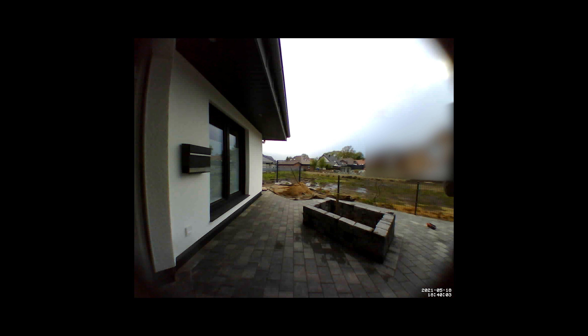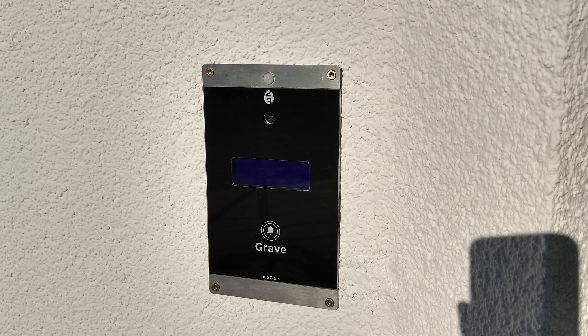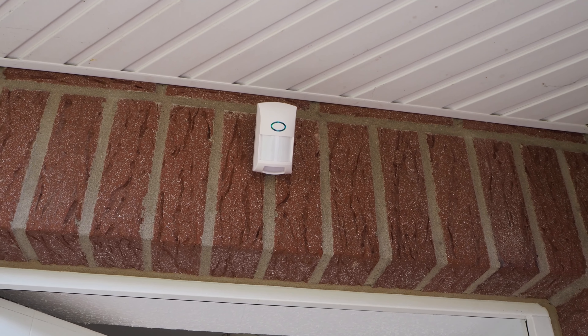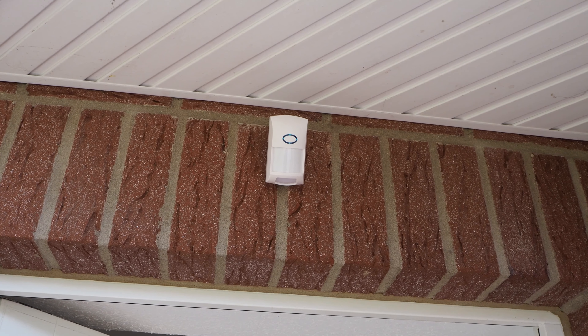But hey — 5 bucks for a camera. I also tested different motion sensors, but neither PIR nor microwave radar work properly. Most of the time they trigger too often, and if the sun shines on the infrared sensor, of course that's a problem anyway. But maybe it's due to position, because my 433 MHz PIR motion detector works great.